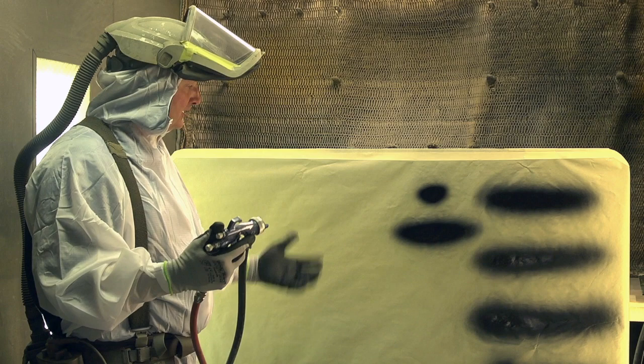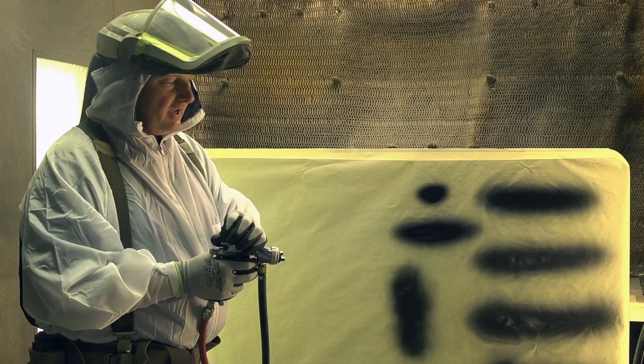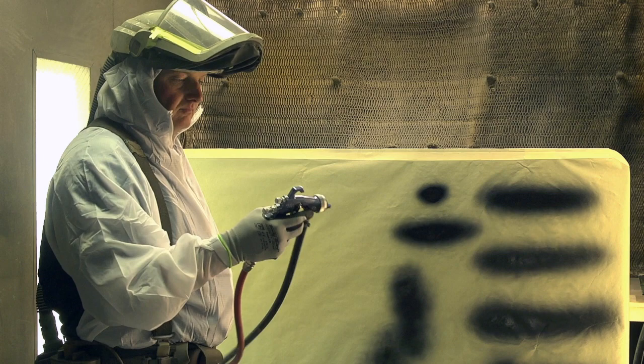Now that we've got that done, we can go over a few other things. Keep in mind, if you're painting something smaller, you can make your pattern smaller. When you're painting a smaller piece, you always want to make sure that you're overlapping each side by about an inch. When you come to the end of your part, don't be afraid to paint out past it just a little bit — instead of getting a light spot on the end that'll just be rework.